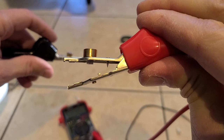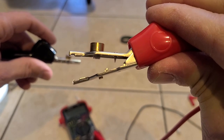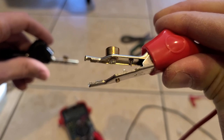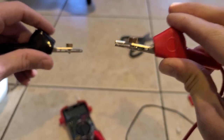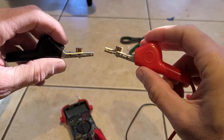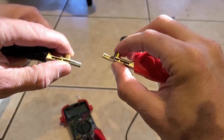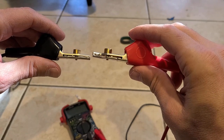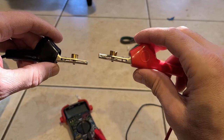There's also a larger nail on the back to go through larger insulation, and then there's the bed of nails right there — a bunch of small prongs. Just be really careful with these: only push them through the insulation when the device or whatever you're testing is not powered and there's no current flowing through it.